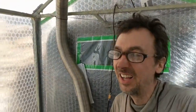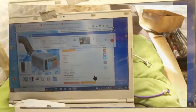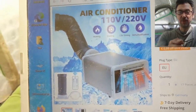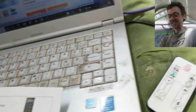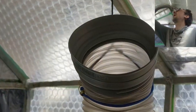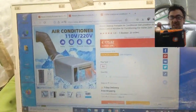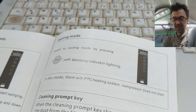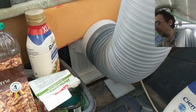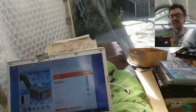That's why I bought this - without cooling I could not work here on my notebook. I found it has a PTC element so it can output heat from the front, but this only works when the compressor doesn't start - and that's not what you want. Technically this is an air conditioner that can be installed permanently and can heat, but heating will simply be a PTC electric element - not the three-to-one efficiency of a heat pump. In winter I would need to turn it around.